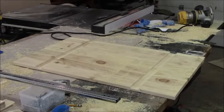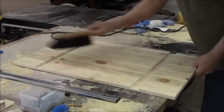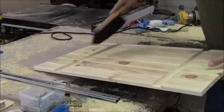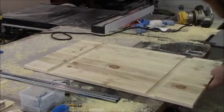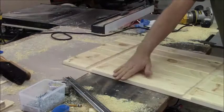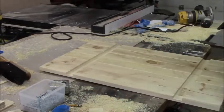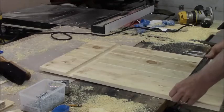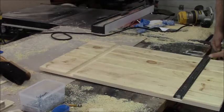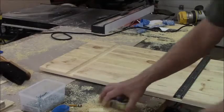Now I've got some vacuuming to do. I've got all my other panels that I made yesterday. Now, this might look funny at first, but this is the leading edge here. This is the edge that goes against the wall. I just cut this panel so that my last board was the same width as all the rest. They're longer than the wood, but that's because there's a two-inch face frame — so these are going to stick out two inches and tie into the face frame. There's just a half inch here — I was going to leave it, but I just blew it out. That's how the two slides are going to go in.